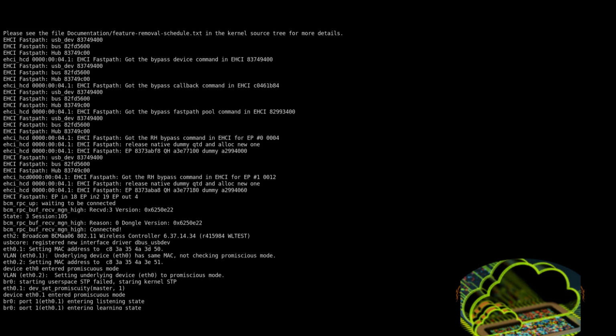We're using voltage. If you're trying to use a device whose voltage isn't properly matching this adapter, then you can have problems. You might also have problems if you're using faulty hardware that's outputting a voltage you don't expect. Then you could possibly burn up the device or your USB port or your motherboard or whatever. So it's nice to use something like this and not risk a $169 device for something that you could use a $5 dongle for.